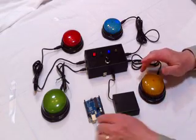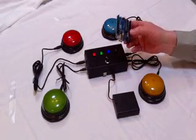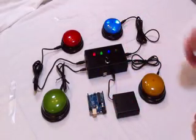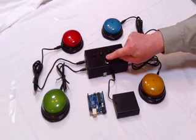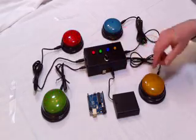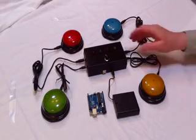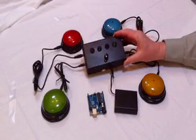It was a great first project if you're thinking about using the Arduino and haven't used it yet. Very handy for taking the inputs and driving the LEDs and the button logic. We put in a light test mode, so if you hold the reset button down for 3 seconds or so, then it verifies that all the lights are working and all the buttons are working. Of course, there's an Easter egg in there too for anyone who's reading the program or programming your own. You can see what kind of Easter egg you might want to put in.